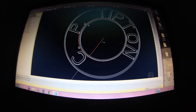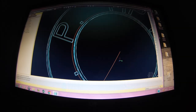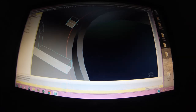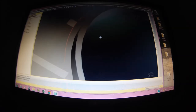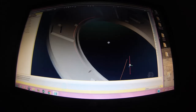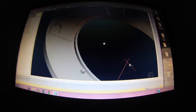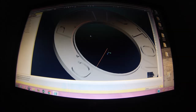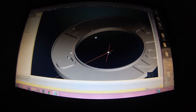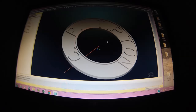Now when you're doing something like this for a volume milling operation, you have to know what size your cutter is. And then when your model is complete like this, you have to zoom in on these little features and make sure that that cutter is going to fit between those two walls. And if you're going to use a toothpick size cutter, it's going to take you forever to whittle this thing out. So you want to use a cutter that's not going to snap off 11,000 lines into your program and you have to start over. And there's 2 hours out the window. So there's a lot to be considered when doing something like this. And it was quite a juggling act to get to Chuck's final.